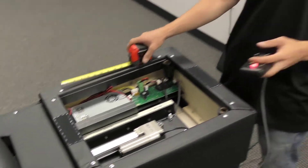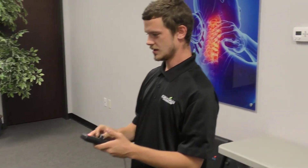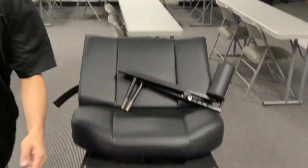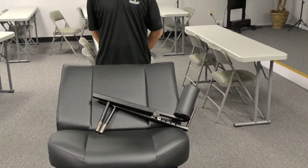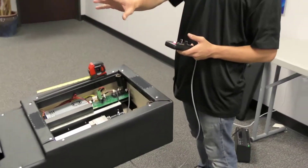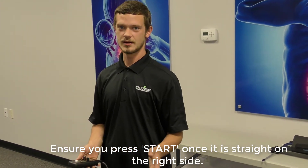The next part of the calibration is centering the four inch actuator, and this part is a little difficult because there's no measurement — it's all about your perception. What you have to do is just center up that actuator. You can do that by standing in front of it and looking, and then you will have to move behind it. So let me adjust that up a little bit more. That looks straight — that is straight. You can go ahead and press start on the direction that it's straight; it's swiveling left and right right now. So if it goes right and it's straight, then it is key that you hit it whenever it goes right. If you press it whenever it goes left, then it's not going to be completely center and you'll have to do it again.